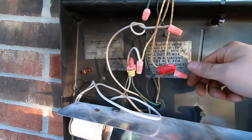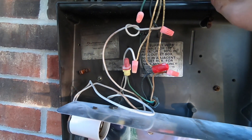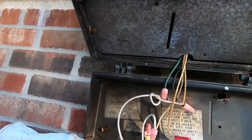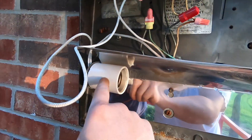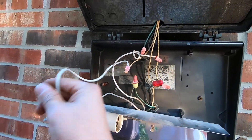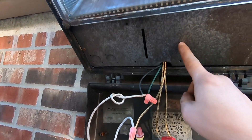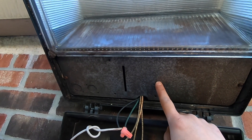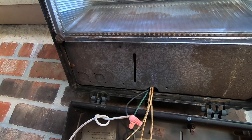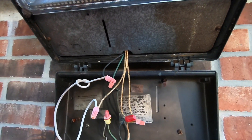The first thing we're going to do is open these up. Instead of the cable going up into the equipment up here, we are just going to connect the cables that go directly to the socket. There are two cables going from the socket — this is one of them and this is another one right here. Right now they're going into whatever device is here — capacitors and ballast — and we are going to disconnect these and connect them directly to the power source.